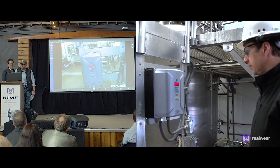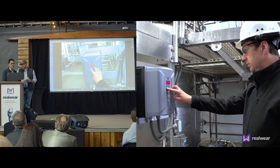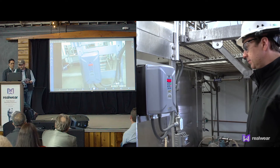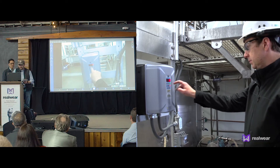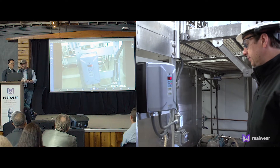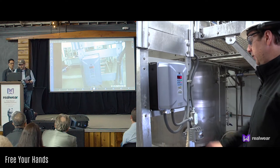Now you're going to use the down arrow key. You're going to go to P000. Perfect, there we go. You're going to hit program. Press it just one time — you're going to see a single display. Now we're going to set it to five. Use the up/down arrow keys so it shows five. There we go — there's five.